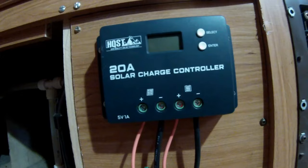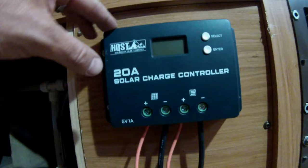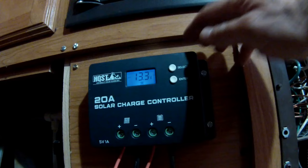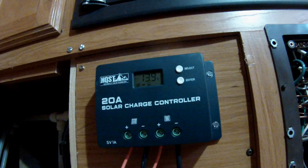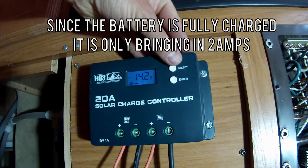I'm going to go ahead and re-hook up our battery and double check that we're getting a voltage reading and everything. And if we're good there, I'll jump up on the roof and get our solar panels plugged in. There we go — 13.3 volts on the battery and zero volts and amps coming in from the solar panels. So let's go plug those in. We are working, baby! We're bringing in two amps, our battery is at 14.2 volts right now, and our panel is bringing in 15.9 to 16 volts.